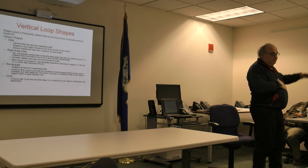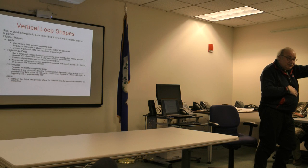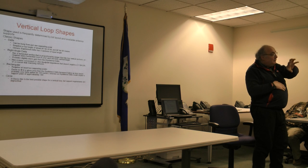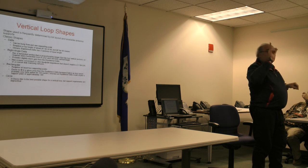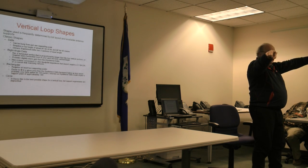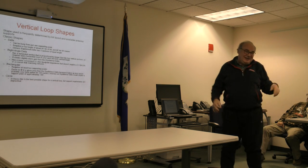What I haven't told you is, I'm up on a knoll that rises 40 feet above Scalzi Park. Now, despite what anyone will tell you, signals don't go straight up in the air. They go down on a plane, basically bounce off the Earth's surface, and then go back up again. If you're lucky enough to be on the rim of a hill, it's like adding the hill's height to the net height of your antenna installation in the direction that you're trying to reach. So looking over the roof of my mother-in-law's house, which you will look at in a minute, Africa, South Africa, Europe, all downhill where my lot is located. It really worked out well with the dipole, then the damn tree came down.